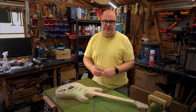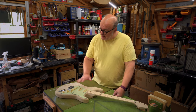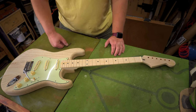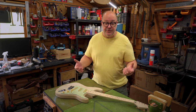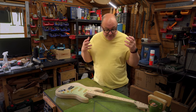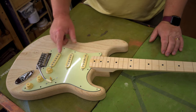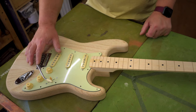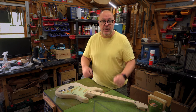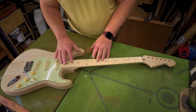They can be slightly different depending on what era of guitar they're emulating. I'm going to turn this into a sort of '54-style Fender Stratocaster - hence the maple neck. The body I might go solid color, not sure - it all depends on how the repairs go. The temptation is to just screw it all together and start playing, but when you look at those guitars they're usually an absolute mess. The neck socket may be sloppy, the scratch plate may not be centered, the bridge may be off center so strings don't run central down the neck, the neck may be off center across the pickup poles, and the neck dimensions may not fit the bridge dimensions - which is a disaster.